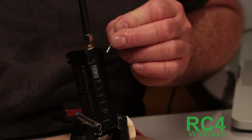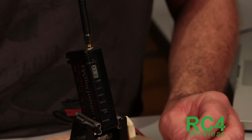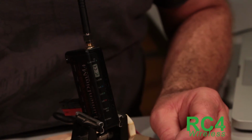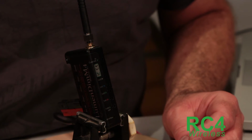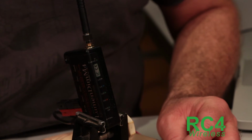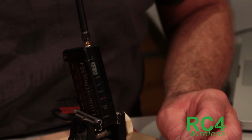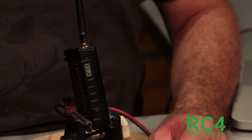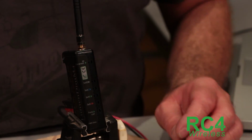It's also important to remember when you're doing an update like this, you should not have your LumenDim transmitter powered on. If the RF section of this device is linked to a transmitter, the firmware updating process is not going to work. Best thing, just turn it off, have your device separated from any functional system. This is the process of firmware updating. You're not trying to run a show at the same time. Do the updates and then go back to running your system. Nice and simple. Have the blue light not on, which tells you you're not connected, and then go ahead and do this process.